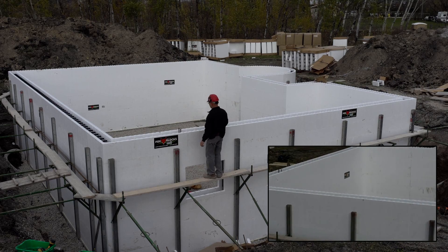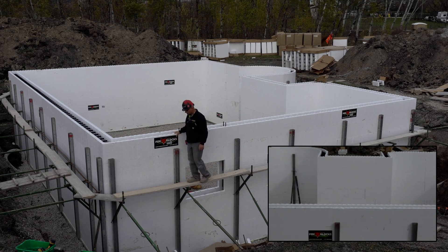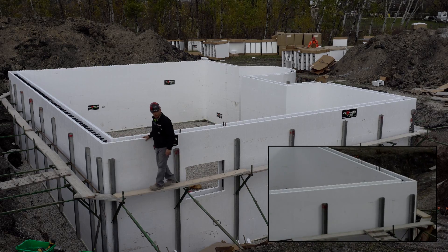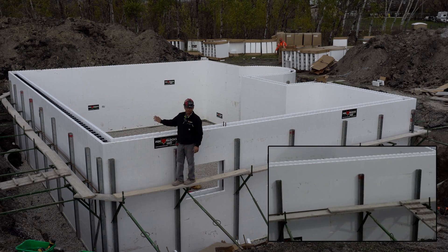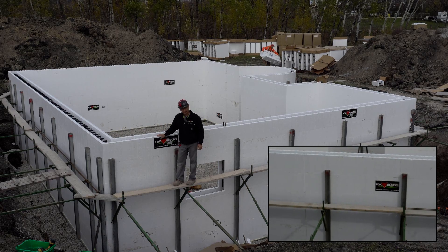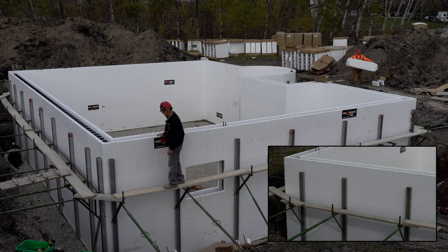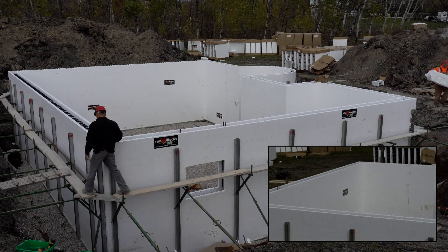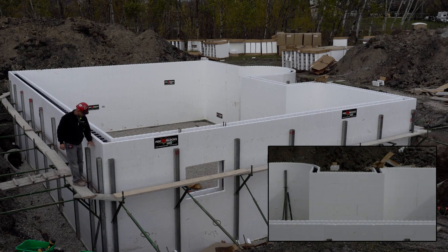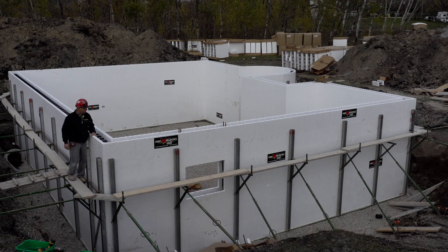The radius is done, all the corners are done. Now we have to do strapping, and we still need to put a screw in the top of our bracing to hold it since it's a little loose. It's important to keep these walls nice and straight because we're placing concrete into them — if they're not straight they will stay not straight during the pour. The walls have a memory, so it's good to have them in a straight position for a day or so before the pour. We also want to keep the top plastic tie in the fox blocks free from concrete — we'll keep the concrete only halfway up on this block, which will allow us to use our HV clips to clamp the next row down.